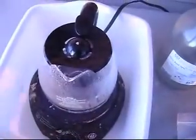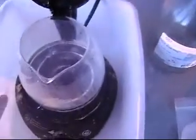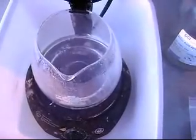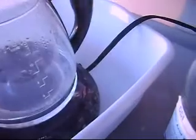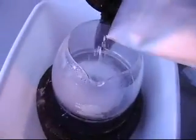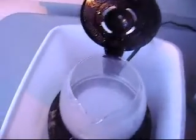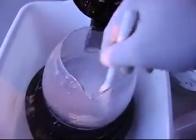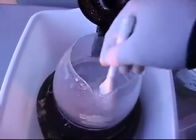I'm going to begin to add the 700 grams of sodium nitrate. There's really nothing too complicated about this — you're basically just adding the sodium nitrate and letting it dissolve into solution. I recommend that you do 50 to 100 grams at a time. It'll make it go a lot faster and it'll be a lot easier. One thing to note is that with the saturation of the solution, you're going to want a coffee pot that can hold at least 10 cups for 500 milliliters worth. By the time this is all said and done, it's going to be up to about 8 cups. Any that doesn't get dissolved, just put the filters back on and let it boil.